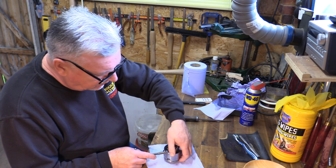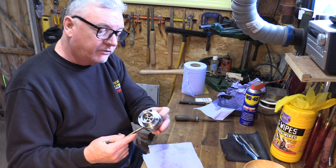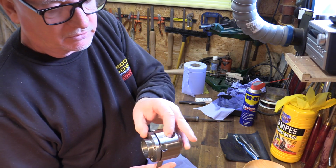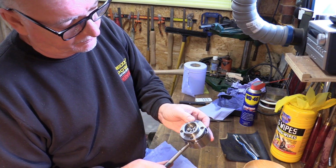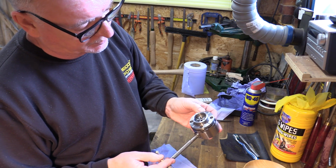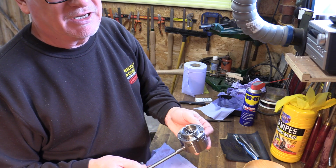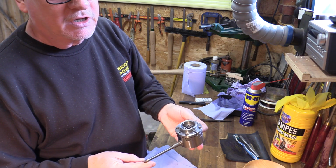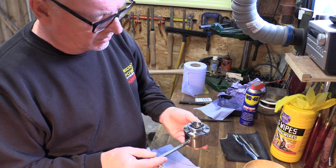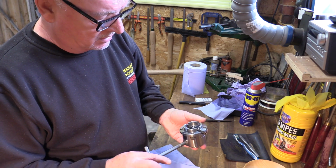Okay. So if I turn that over now, put my finger in the opposing hole, just be careful when you do it. So I've got the key in there, that in there. So I'll pinch down to the jaws, and then what I want to do is back it off, keeping my finger in place on there. So all I'm doing really is just supporting the ring on the other side, so it just doesn't twist. And what I want that to do now is come out to a stop.